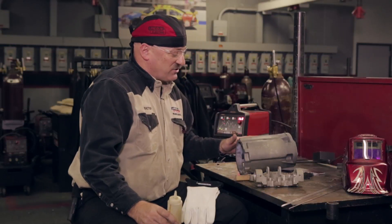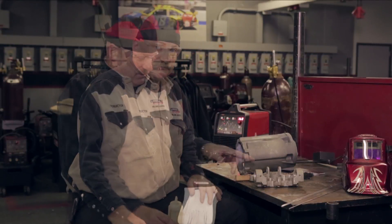This is a magnesium casting; this is an aluminum casting. Strangely, you have aluminum alloys that have magnesium in them — they can have up to 6% magnesium — but it doesn't react on those. But the magnesium alloys, even though they have aluminum in them, it does react.